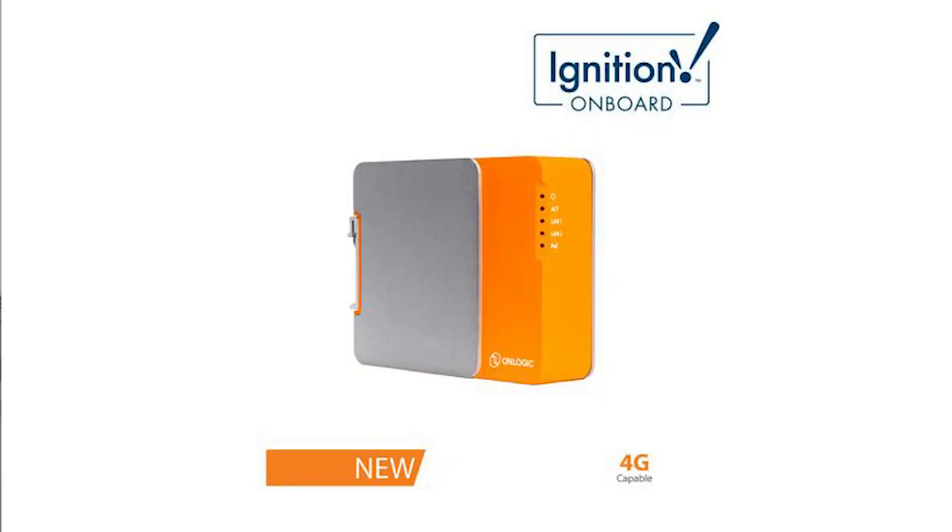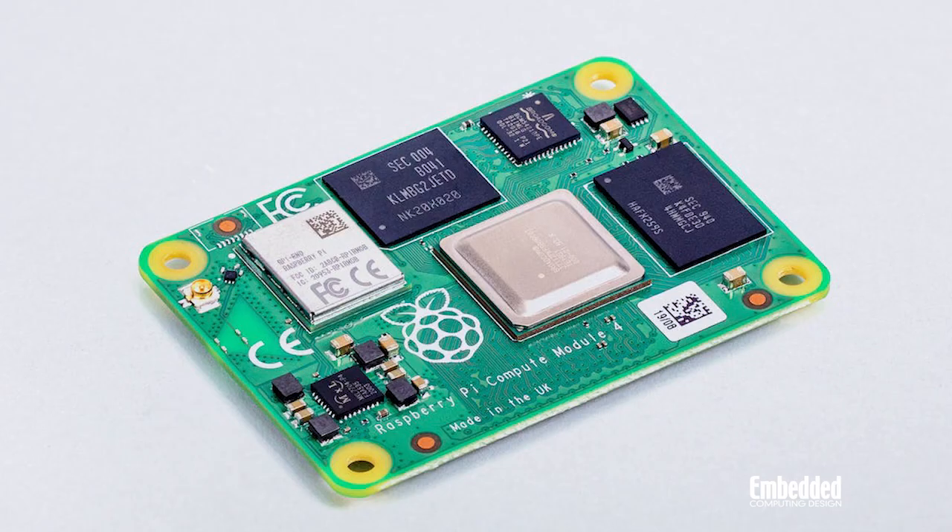This may come as a surprise, but Raspberry Pis by themselves are not industrial grade. But what if I told you that there's a kit out there that could turn a Raspberry Pi into a SCADA gateway for automation facilities that requires little to no integration at all? Well, it's right in my hands, and it's called the OnLogic IGN 800 Industrial Raspberry Pi IoT Gateway. The IGN 800 is a 4.04 by 5.08 by 1.5 inch fanless aluminum-encased industrial edge gateway capable of operating from negative 20 to 60 degrees Celsius, powered by the Raspberry Pi Compute Module 4.